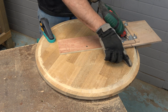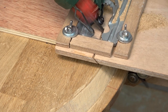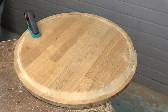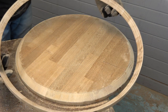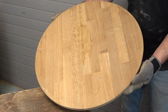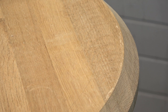Here I have the line that tells the end of the bevel. I have to cut until I reach the line. I take the bevel cutting jig away — it doesn't look like it, but it is a perfect and precise cut. Here we can see one side of the circle, and here the other side with the 45-degree bevel. A clean and perfect cut, perfectly parallel to both sides of the circle.